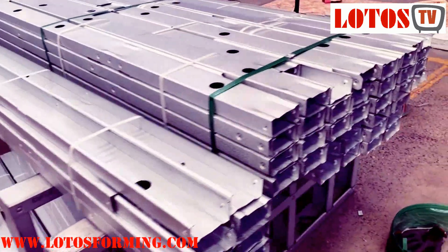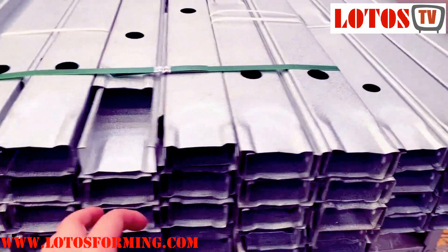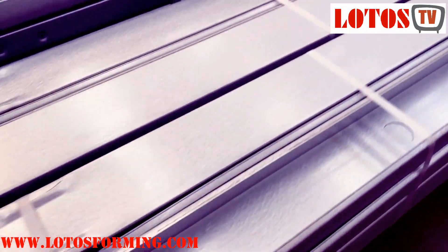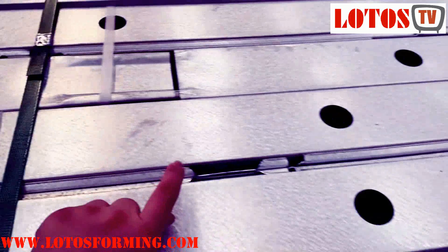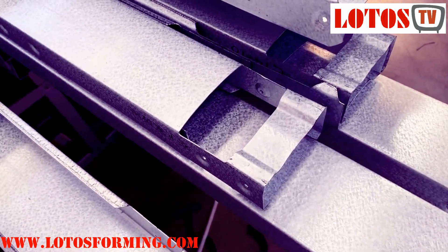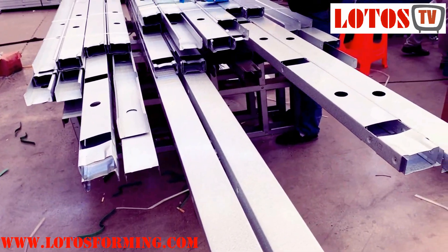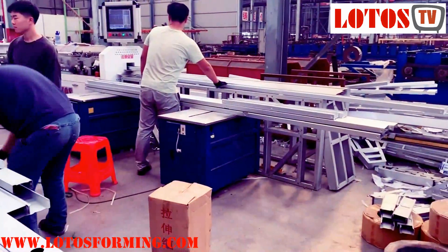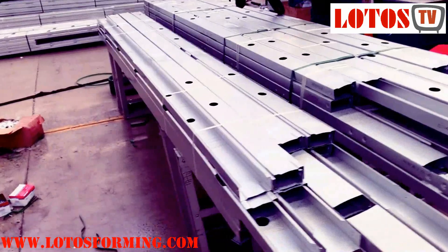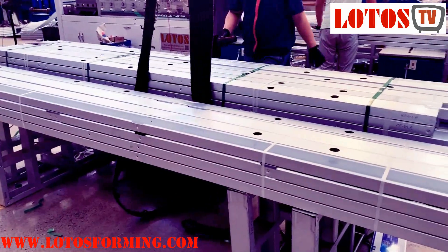This is all the product produced by the machine — the necking. This is what we call necking. The line is fully automatic — no matter whether you want to do the punching or this kind of notch, all of the notching, necking, and punching is done by the same machine. The machine will calculate when and what to do based on the drawing, and can read the drawing fully automatically. The system will analyze what to do and what profile is coming from the machine next. It is produced one unit at a time, and then packed by one structure — not packed by same length or same profile, but packed by same structural unit.